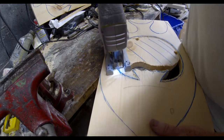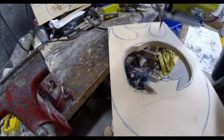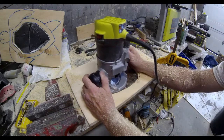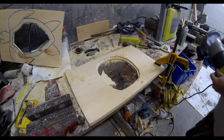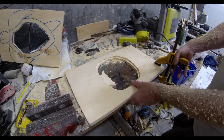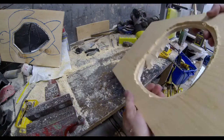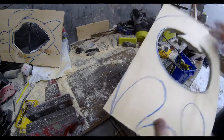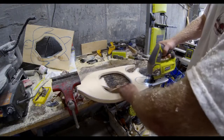In this particular case, I'm leaving that fin in place that will kind of protrude into the picture a little bit. Once the inner circle is cut out, I'm going to use a router and router a groove around the entire circle — just a small quarter inch groove, just enough to allow plexiglass to fit into that groove, just like the glass of a picture frame. It doesn't have to be real neat. I always like to do the inside hole and the routering before I cut out the outside shape of the fish.